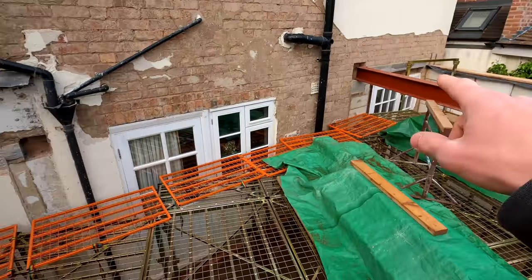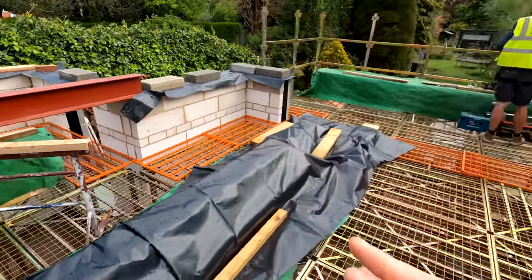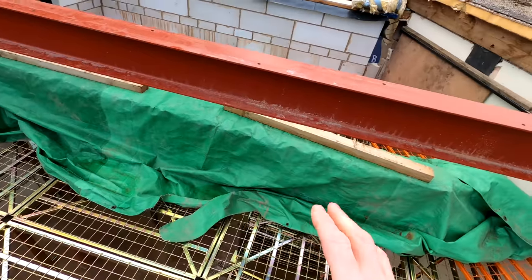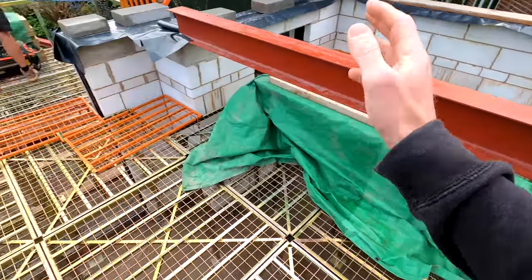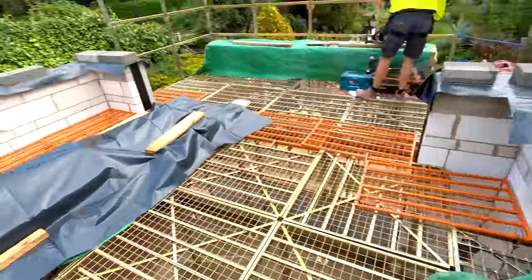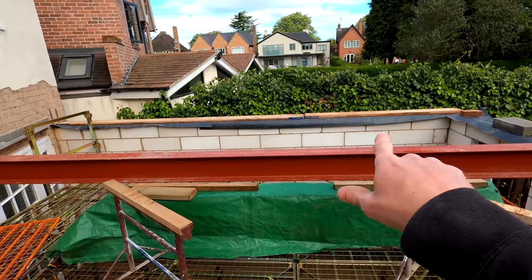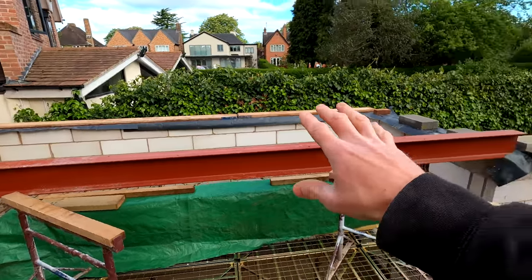So what we're going to do first of all is get that steel done the same. So we're going to do the cut on there, get the angle right. We do need to grind a little bit of that pad stone down there too. Once we've done that then, if you remember, I've got all the timbers cut here, which are basically just going to drop straight in. There's going to be one big Velux window here, which is actually going to be an electric opener. And then on this side over here, there's going to be two windows, one there approximately. They're going to be solid fixed windows.